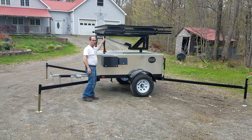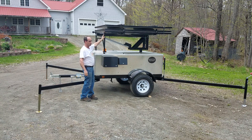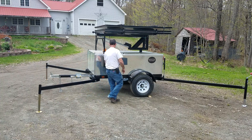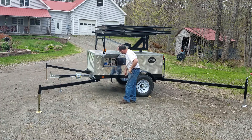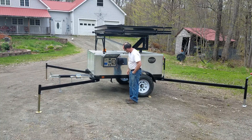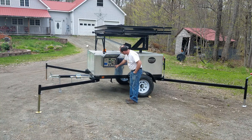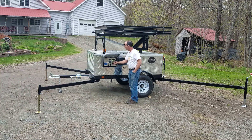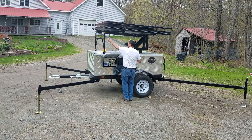This is in the transport position. There's a folding holder here that supports the unit when it's in transport. There would ordinarily be a strap around this, but you obviously have to take that off. At this point you can go ahead and start it up — just turn the main switch on. It's going to go through its checks. Just follow the prompts on the screen. When it's ready it'll tell you. It says: move joystick in any position to raise the array. Just flip it in any direction. Once it clears the rack, fold that rack down.